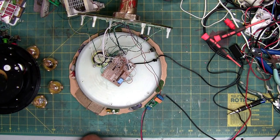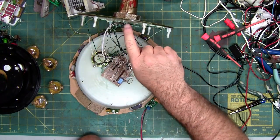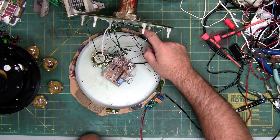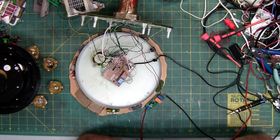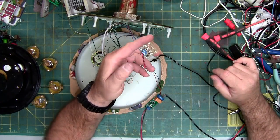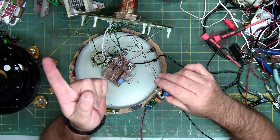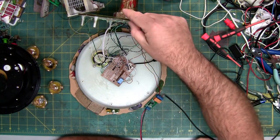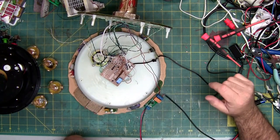When you do remove everything, you need to isolate the LEDs. This green and white wire goes to these LEDs; this black and dark green wire goes to these LEDs. You need to figure out the patterns — all the black and green together, all the white and light green together, and this one is green and gray. They flash in separate patterns or pulsate. This has about five different light string patterns: this string is different from this one, which is different from this one, and so on. You have five pulsating patterns, which is why there are so many wires for the lights.